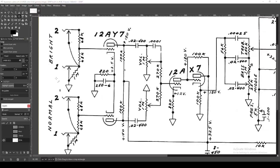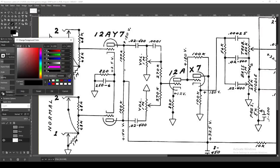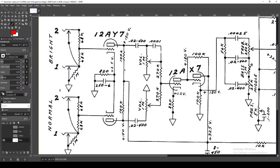Let's start at the input. The Bassman is fairly famous for having this four-input style, which you also see in the JTM45 and the Plexi, but not in the JCM800. This input style is very interesting — basically you're setting the amp to have two parallel paths. You've got the bright channel on top, signal comes in and joins here, and then you've got the normal channel with its volume control joining at the same point. These two parallel inputs are a very fascinating setup that I've come to really enjoy in amp design.